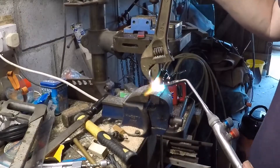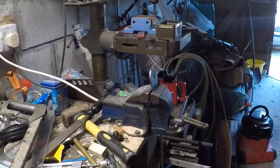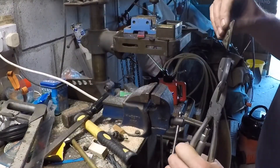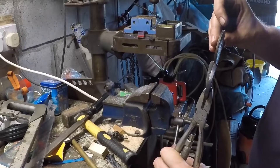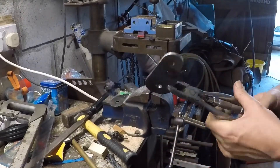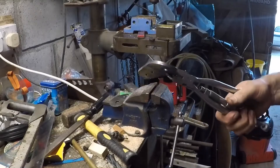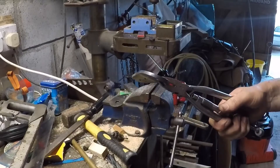It's cool. So nice. I reckon that will do — it looks about right. Let me try it against this one. Yeah, I think that's not bad. I did rather destroy the evidence but it's just bent slightly less than the other one was, so that's good. Not sure whether one should quench chrome moly — probably not, definitely not if you're doing a fitting for an aircraft, you make it all weak and nasty. I think I'll just let it air cool — it is the normalised version anyway — and then clean it up and bolt it on.